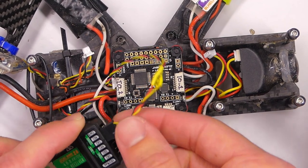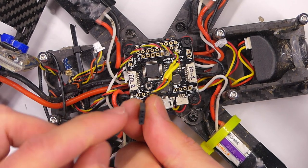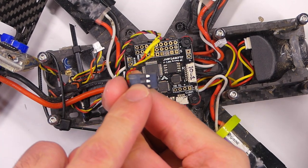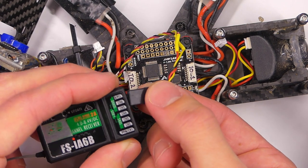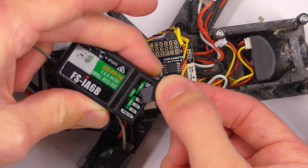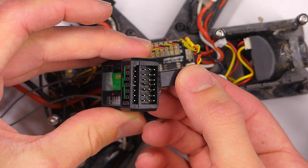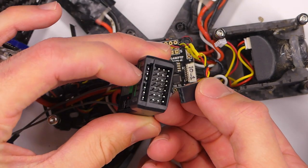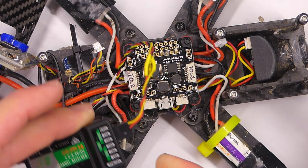What you want to do is make sure that this connector cable here — it's gonna have a servo style connector on one side. It's like a flat black kind of cable and you want to plug that into the port on the receiver where it's green and says iBus, and on the right hand side it says servo. You want to plug it into this port right here.